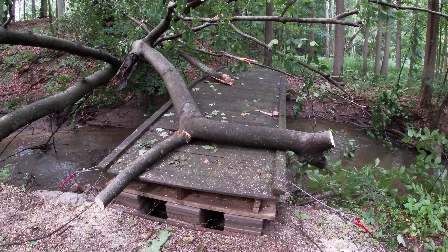I supported the bridge up, built a temporary wall down in the creek bed, raised the bridge up on it, and I poured a concrete retaining wall underneath here. Then I poured a concrete cap for all this stuff to sit on and raised it up a little more. We get some big rains down here, and this would be underwater — the bottom of the bridge would be all wet and packed full of mud, and that's what started rotting it out. So I got it raised up, got all this concrete poured, and replaced a bunch of lumber underneath here for support.